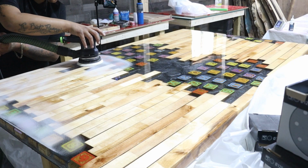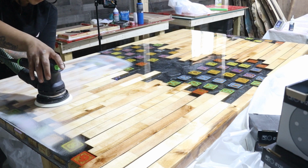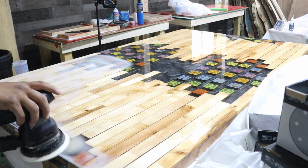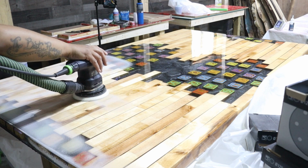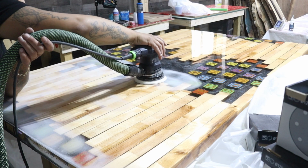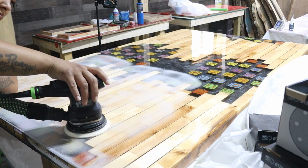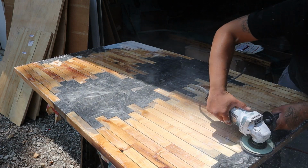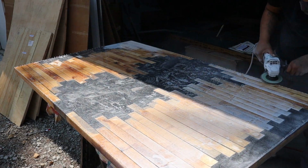Okay, so you're probably like, why the hell are you doing this after you just got a perfect finish? I didn't show the other two pours for the finish because I wanted to show this process. I'm going to be using Stone Coat Countertop's Ultimate Top Coat. And the reason that I'm doing that is because this is going to a daycare, and you cannot scratch it. So it's a roll on. You use rollers, like paint rollers, and it just creates like this barrier. So being that the kids are going to be on it and stuff, that is the route that we chose to go. So I'm getting all the drips off the bottom.